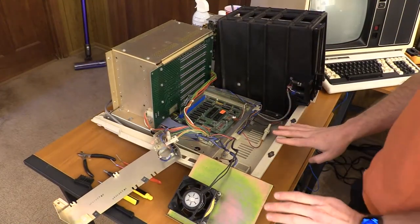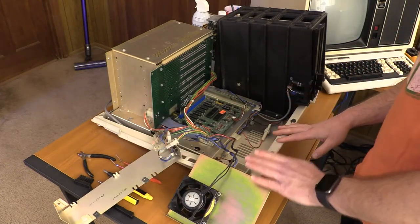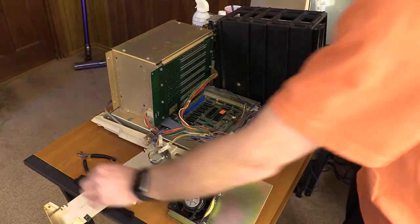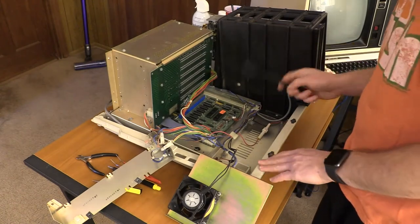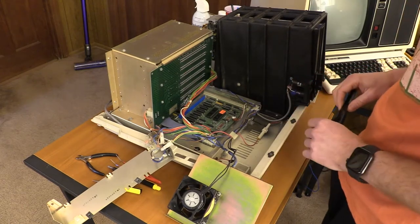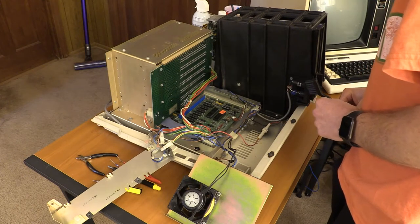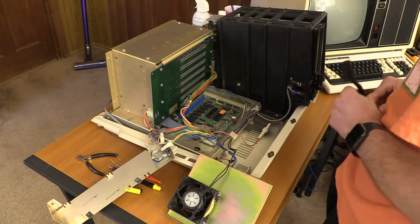All right, the 16B is back. I'm still going to try and not take apart this terminal block — we'll see how I do. All I really want to do is pull the card cage off, take a closer look at the board, maybe pull these ribbon cables up, and go over it with the brush and a can of air. The hope is that with the ESD safe brush I can just get any gunk out of there. I really want to use the opportunity to make sure there's nothing out of whack — no components touching, no shorted caps, no bent test pins or anything like that. And then if it looks good, I think we're going to try and power it up without the floppy drive and see what happens.